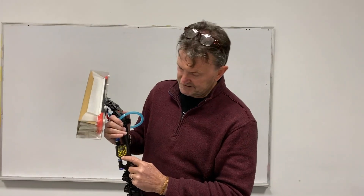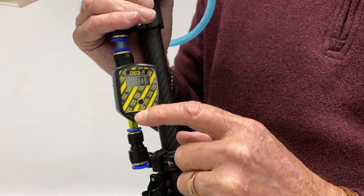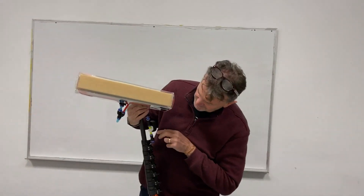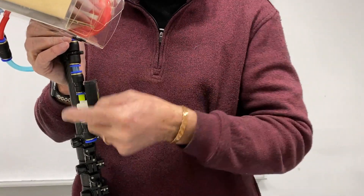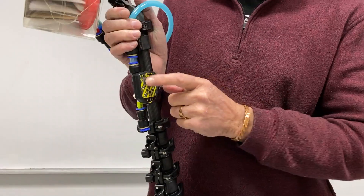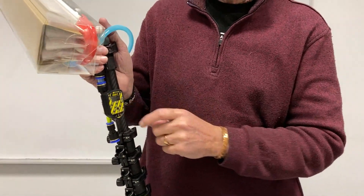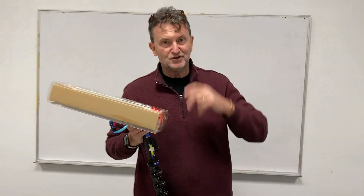You want to see TDS 10 or lower — there's a green, orange, and red light at the bottom. If it's less than 10, the green light will be on. A TDS meter is an electrical conductivity meter — there are two little electrodes in there, one sending electric current and the other receiving it, measuring the conductivity of the water. If the water is pure, it reads zero. The more minerals that are in the water, the higher the number goes.